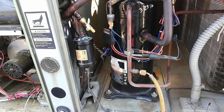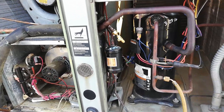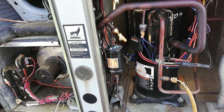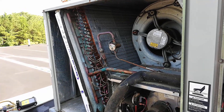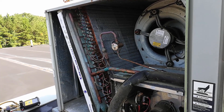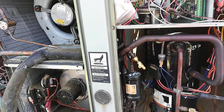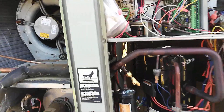It's just not good — they need to stop that. I don't see it on the newer units, so maybe they dropped that trend. I'm going to let it blow through the system and pick up any trace refrigerant that might come out while I'm unsweating. I definitely have to unsweat the TXV because I don't have enough pipe — if I cut it, I won't have enough to put it back together. I'll do the TXV first and then the filter dryer. I need to be careful about these wires in behind the filter dryer.